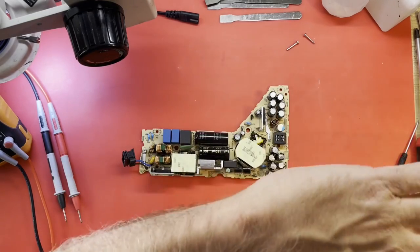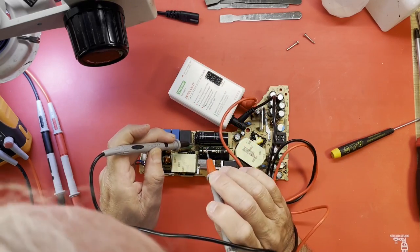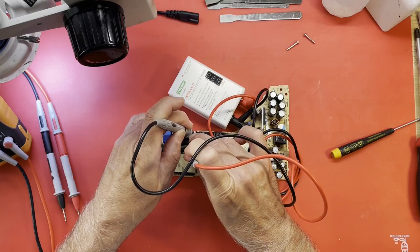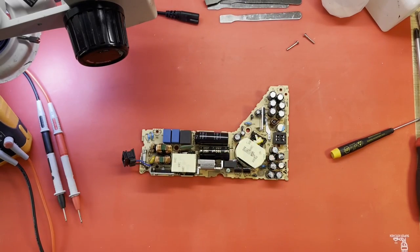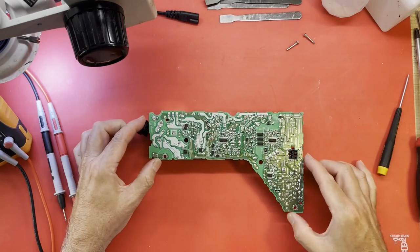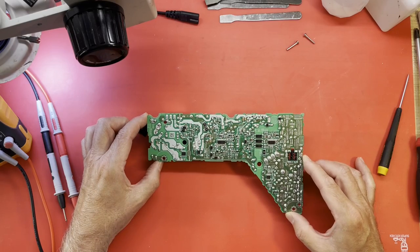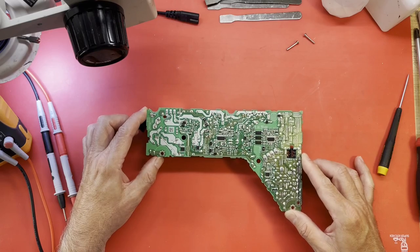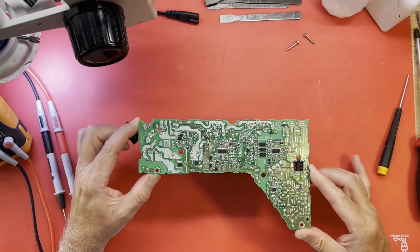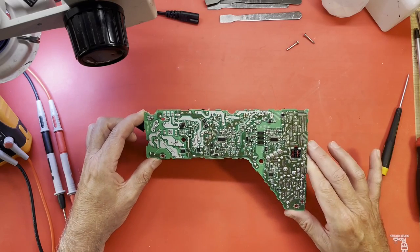Let's just make sure there's no charge on these capacitors. These leads have been rolled up for a while. Nothing. So, yeah, she's pretty dead. Good. I'll see if we can figure out what all they've done to it. You can see where they soldered that capacitor in there, but I don't see a load of flux anywhere. Don't really see any signs of any other. Well, no, I thought I saw a damaged transistor, but no, it's just the lighting over here. It's fine. Thought I saw a crack in it.